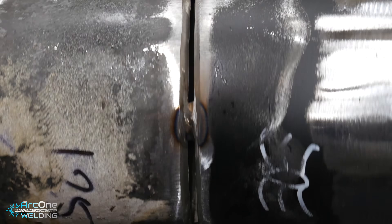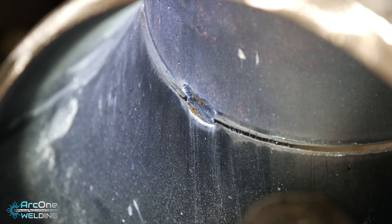Only a flange is going on there so I can worry about height later. Now you're going to see some of the arc shots. The technique I'm using is a short circuit MIG/MAG setting — basically every time the wire touches the molten pool it short circuits and deposits material. Very controllable, but you don't get great penetration because it's low power, so that's why you feather both edges and concentrate the power of the molten pool on the thinnest areas. I'm rotating the pipe at the same time.